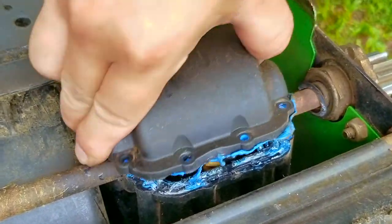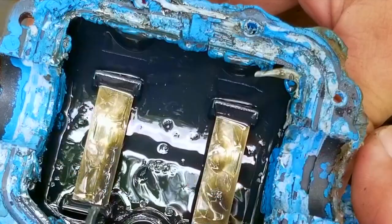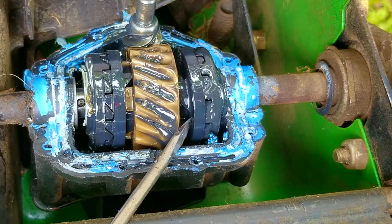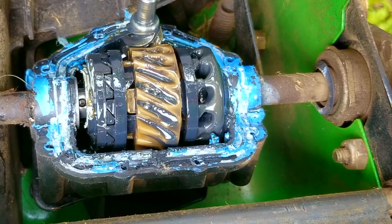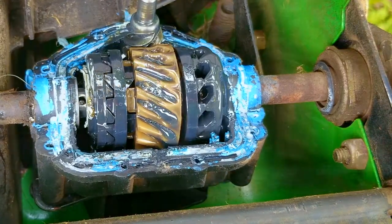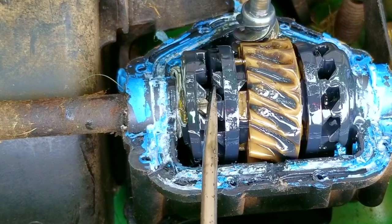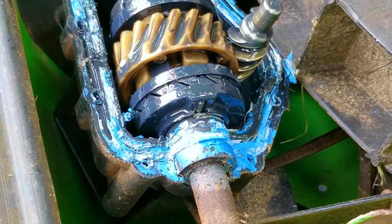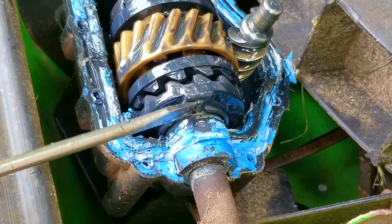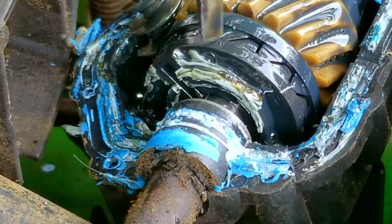After struggling for quite some time we're finally able to see the underside of the cover. I see not just blue sealant but a light gray one as well — more than likely this cover has been off before, probably for the same reason. On the good side you can see how the gears are supposed to work: spin one direction and they catch, then disengage the other direction. The gear oil is also very dirty so we'll need to change that. On the bad side the gears aren't turning and the problem isn't obvious just yet. Looking at the good side we can see a pin that goes through the axle and seats in the outer plastic gear. On the other side, however, that pin is gone — it's either floating around the gearbox or it's jammed against the case.